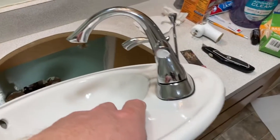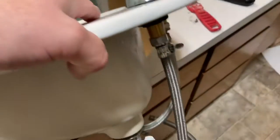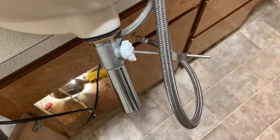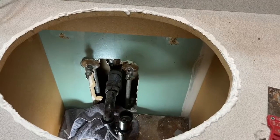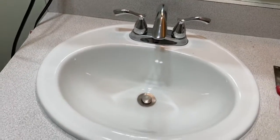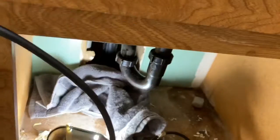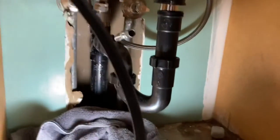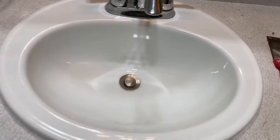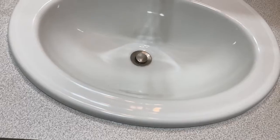I've got the new sink with the faucet installed per the instructions. I attached the hoses in advance and I've got the plumbing piece there. Alright, put a line of caulk around the rim and set the sink in. I did have a helper just because this one pipe is too long to guide those two pieces together, and then I wiped away the excess caulk up here, so now I'm going to make connections down below.